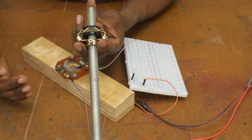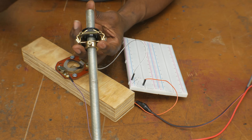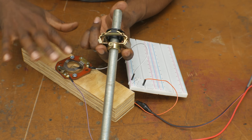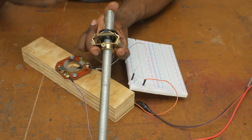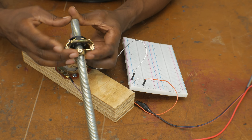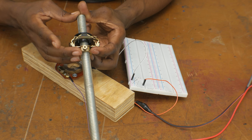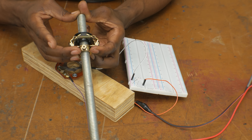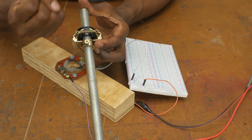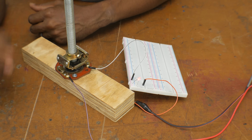Here's what makes this device so clever. You want it to open at about 85 to 90% of rated speed, to give just enough kick without overheating the motor. You also want it to snap closed very quickly, otherwise you'll be wearing out the starter winding. So these weights are carefully calibrated to open at exactly the right speed. Make them heavier and they open at lower speeds; lighter, and they open at higher speeds. Calibrate the spring just right and you get a nice, crisp, quick snap back into place.